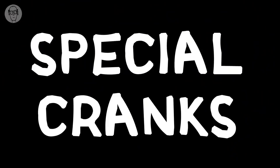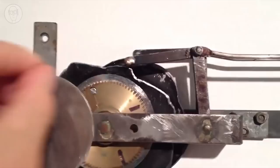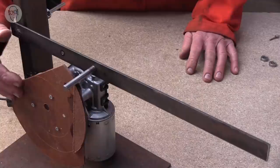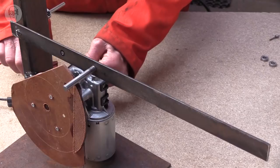For more complicated movements, there are cams. Some people get really clever at using cams and have done some amazing things with them. A couple of things I find useful with cams: if the cam's at all complicated, it's very hard to get it right first time. So I like to make a rough version out of hardboard or aluminium that's easy to chop and change.